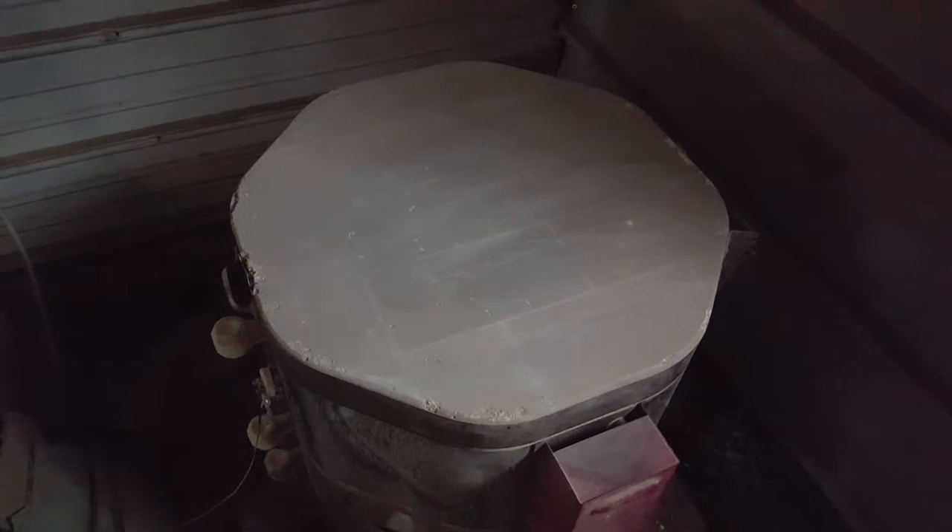I have not opened the lid to the oven since I fired it up earlier today. What we're going to do is open and close that lid a bunch of times to help drop the temperature really fast. It's 1400 degrees right now — it was about 1530 earlier and it's dropped that much in about 10 minutes. We want to get it down to a thousand degrees as fast as possible. The first reason is devitrification, where the glass can actually crystallize a little bit in the 1300-degree range.